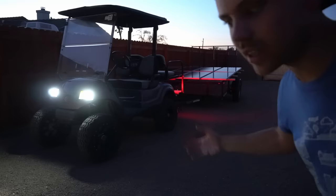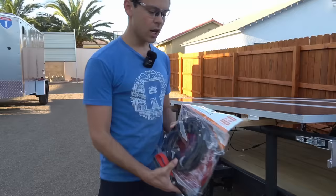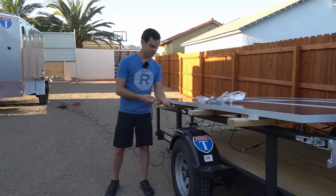Good morning — we need to hook this up to the second solar trailer and run some wire. We're going to use 50-foot, 10-gauge solar extension cables by Rich Solar. Note: on these cables the red is negative and the black is positive — that's not ideal, so watch out.